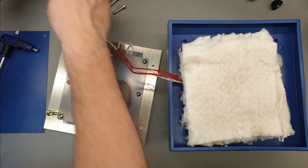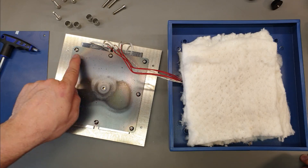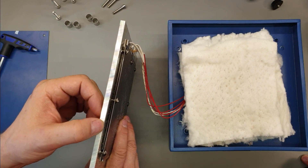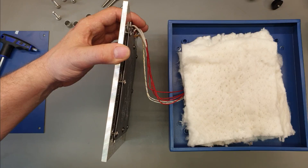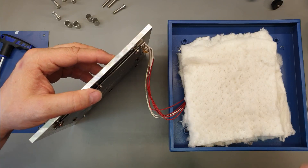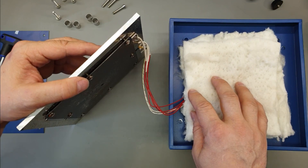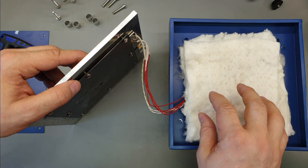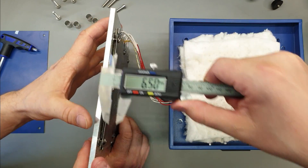There are more standoffs inside - and look at the elements, they're flat. Yeah, there'll be a nichrome wire, kind of like in your toaster, wrapped around a bit of mica. It does look like that plate is pretty thick - five or six mil? Yeah, six mil. There's the insulation - it's glass fiber insulation. You've got to be careful with this stuff; it's not like the bio-soluble stuff in your house. If this gets in your skin it will itch for days - it's literally just glass. The stuff in your house is often bio-soluble so it will dissolve. There you go, six mil thick - not too bad at all.